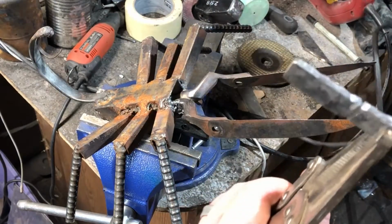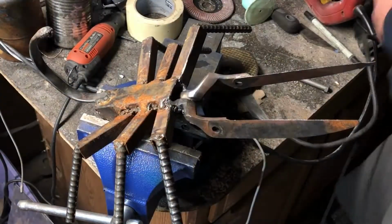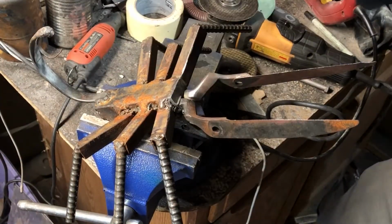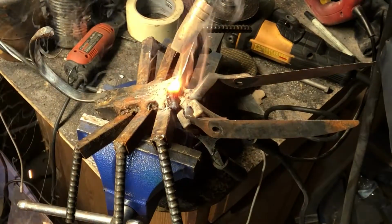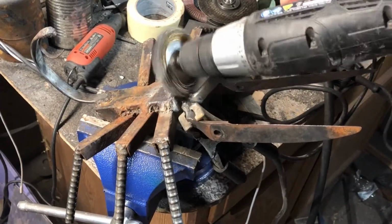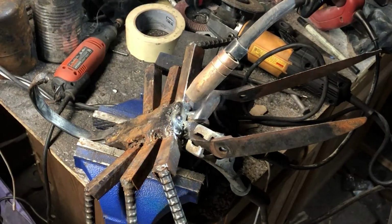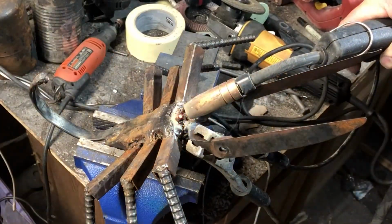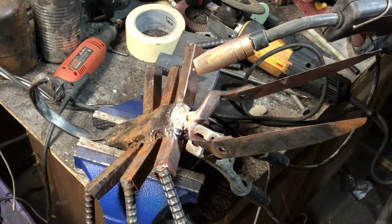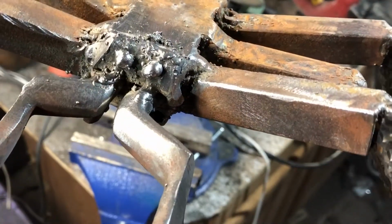I had to come up with an idea for what the eyes were going to be like. Will I put 4 eyes on there or 8 eyes, or will I use nuts or bolts or something like that to be the eyes? And then I kind of hit on the idea of just putting a little plate on there above the mandibles, getting that welded up in a way that it looked reasonably symmetrical. And then building the eyes basically just by making a little tack weld and then a little tack on top of that, a little tack on top of that, and just building up some welding bead there. And I think that worked out pretty well. I like the look of it. When I showed it to my kids, right away they said, oh, you put eyes on it. So I'm like, okay, good. I'm not the only one who can see that this thing has eyes.